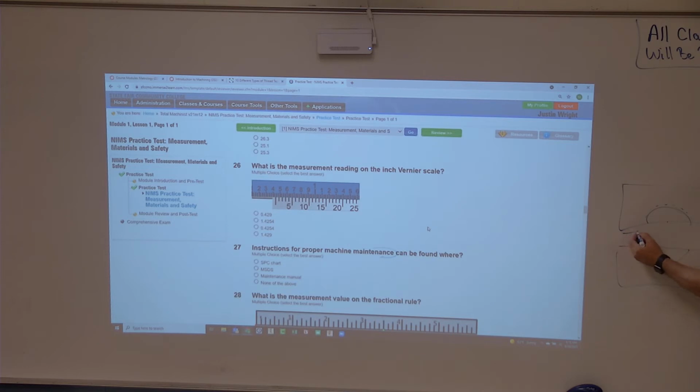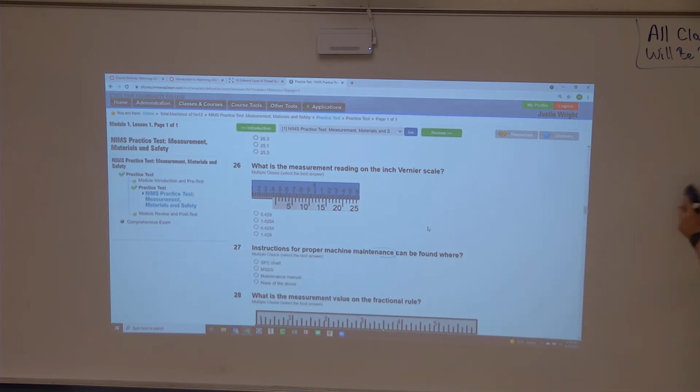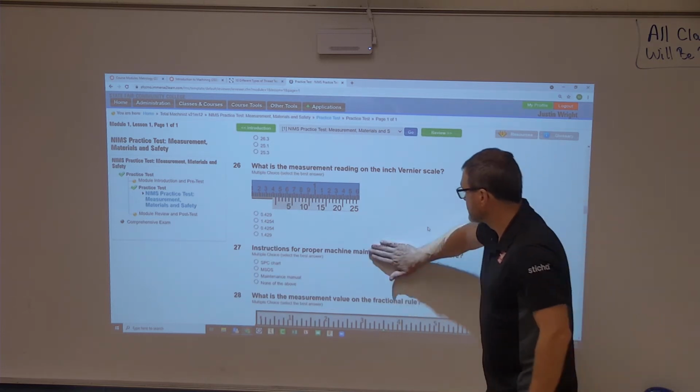So pull this jaw up here. Move your Y from where it was to up here, so that you're milling your hole. See what I'm saying? You have to shift up, or else you're not going to clean up. How much do I shift up that bottom jaw? Quite a bit. An eighth inch, a quarter inch. If you were using a 1/2 inch spacer before, maybe use a 3/8 or a 5/16 spacer now. Okay.